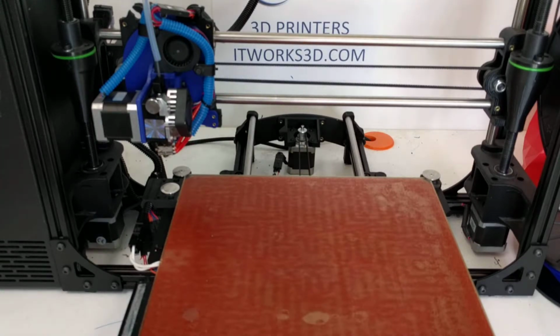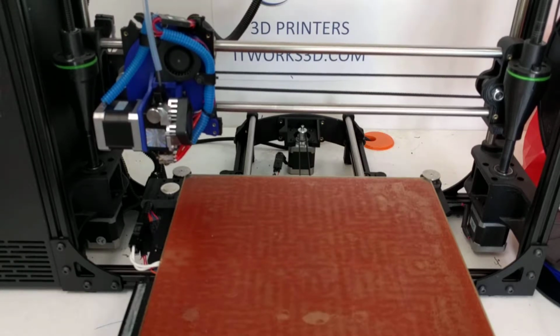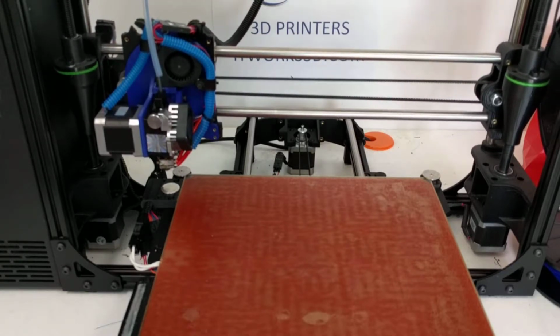Tool head is cooling down to its 175 retraction target. It's almost there. By the way, that 220 is a good filament changing temperature regardless of the filament. It's a little hot for some PLAs. You can usually get away with 200C if you're going from PLA to ABS, for example. But since NinjaFlex and ABS print about the same temperature, I decided to use that.